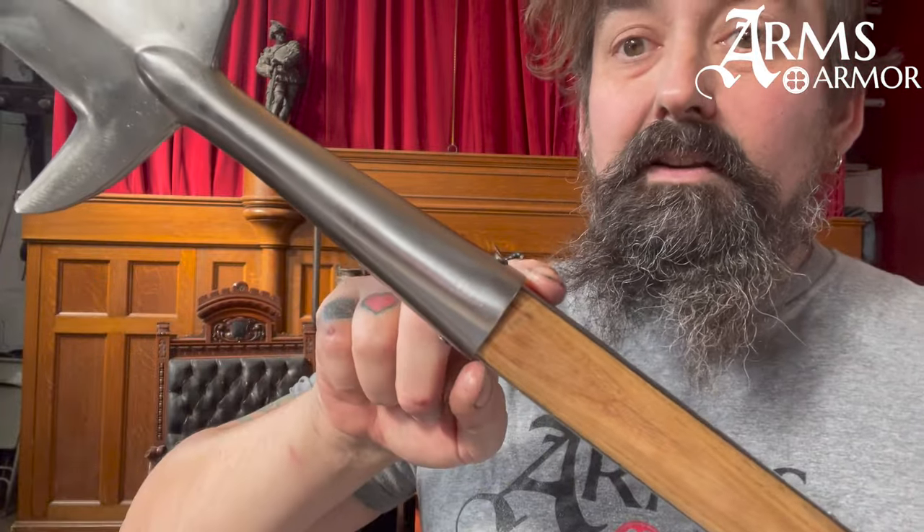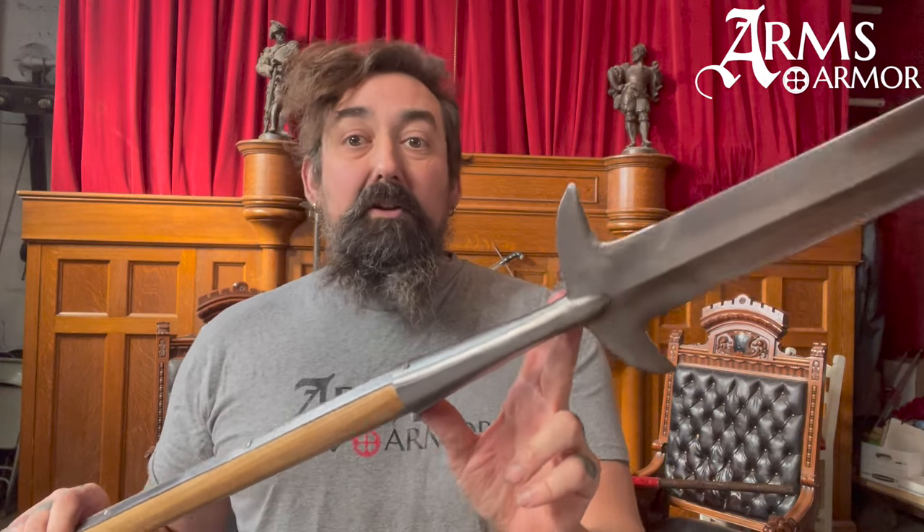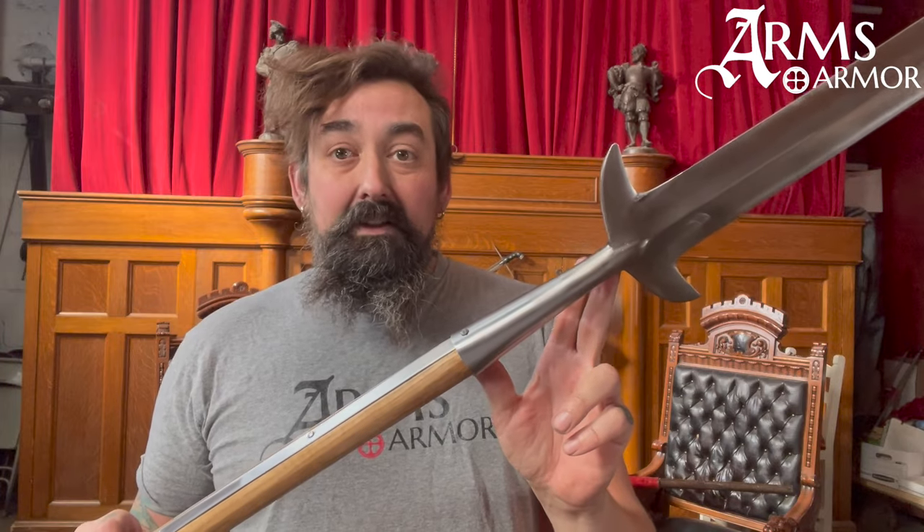You'll notice that these langets on this one are oriented to the cutting edges of the weapon instead of to the flats. Historically we see both of these arrangements — sometimes parallel to the cutting edges, sometimes parallel to the flat edges of the blade. Both happen all over the place, and sometimes they're inset, sometimes they're not. On this one we've opted to run the langet under the socket instead of welding it to the socket, and have pinned it through — this also happens historically all the time. There are just a bunch of historically accurate construction methods that all work. We have a bit of a longer socket on this one than on the original, which keeps it completely secure.